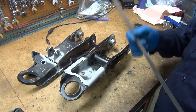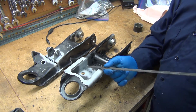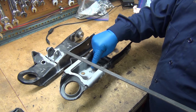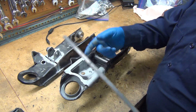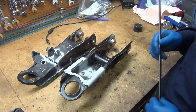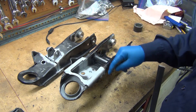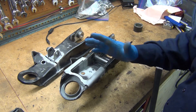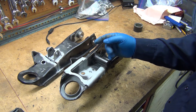...I'll take a piece and lay it down over there, then weld it, and that becomes a bridge and a gusset — like a flat gusset — to help make sure that this joint is super strong. Same thing on the inside here. If it's fully welded, you really don't need it, especially when both sides are fully welded.